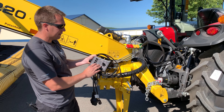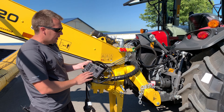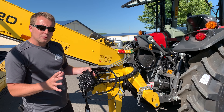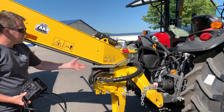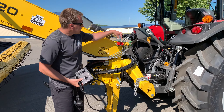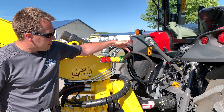All the machines have a fail-safe system — if your control box is not working or you have a blown fuse, you can simply turn your PTO on and everything will automatically turn on and merge to the right. You do not need a control box to run this machine. From this view you can also see the very simple two-point hitch system, and you have three sets of remotes: right wing, left wing, and raising and lowering the machine.